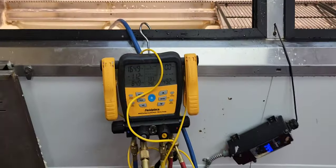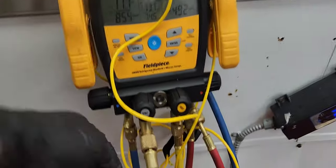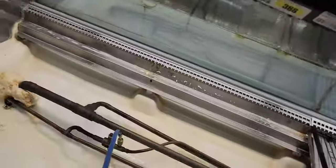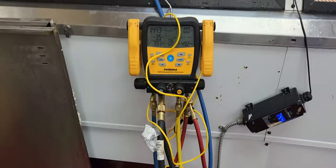So overnight, over about 18 hours, the standing pressure in this circuit dropped to 74. Yesterday, when I valved it off up there, I just closed them straight up. So we had a little bit of liquid in the liquid line all the way up to the expansion valves, and all of that has boiled off already. And so we have just vapor in there, and it was at 74 just a minute ago.